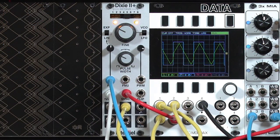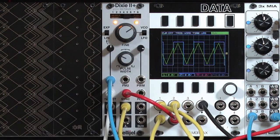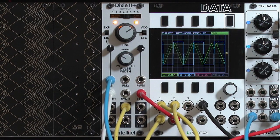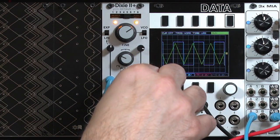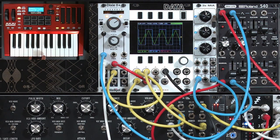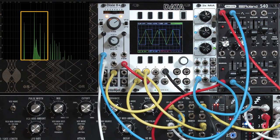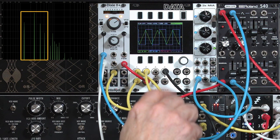The Dixie has an alternate sync mode called Flip, so that rather than resetting the waveform to start all over again when it gets a new rising pulse, instead it reverses direction. Let's move over to the flip side. You'll see the triangle is now reversing and going back to an opposite peak. Here's the sustained tone with sync, and here's the same tone with flip — there's a longer period to the waveform because it's going forwards then backwards, as opposed to going forward and then resetting.